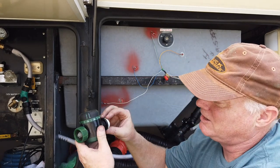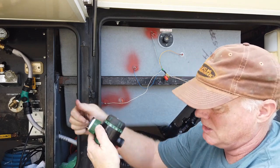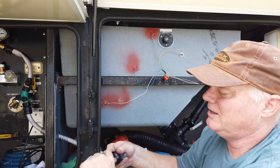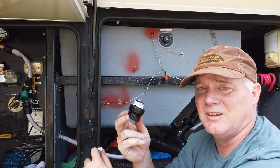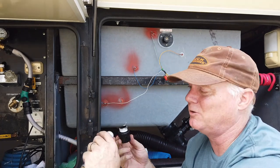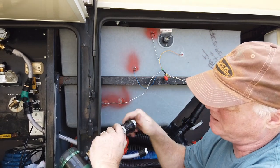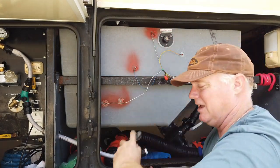After the sprinkler timer, I've got a short piece of flexible hose on the other side, because as we ride down the road this thing's going to bounce and I wanted some protection in there. Then at the end of that we have a couple more things. The first is this backflow preventer - you don't want water coming back from your black tank back through here and into your freshwater side. New coaches have one water line coming in, and with a backflow preventer I'm not concerned. Then finally we'll put an elbow on the end of this and hook the elbow to the black tank rinse.